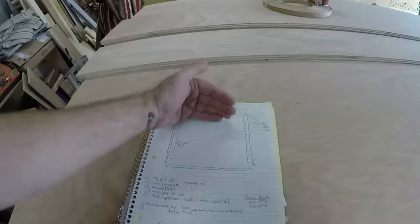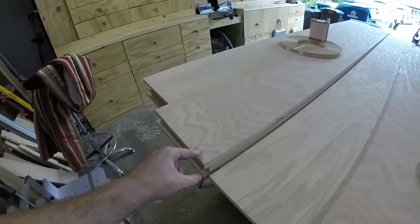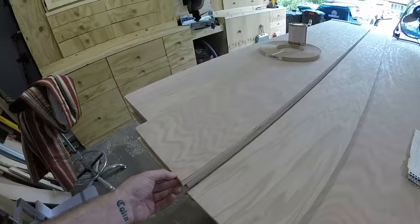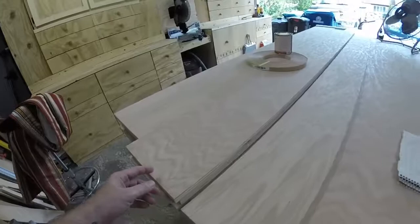One concern is that at 63 inches wide, with a lot of books on the shelves, the shelves could sag, so I'm going to run a one-inch strip of plywood underneath them. I went to the lumber store and they had 11 and three-quarter inch side panels with holes already drilled, but for the price of two panels I could get a full sheet of plywood. I thought they were hardwood but they were just plywood with an edge veneer, so for the price of six pieces I could get multiple sheets of plywood and edge banding — I'm just going to do it myself. I had them cut it up since I'm alone and cutting full sheets on my table saw is a pain.